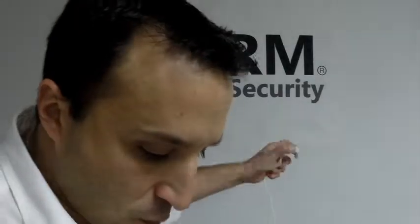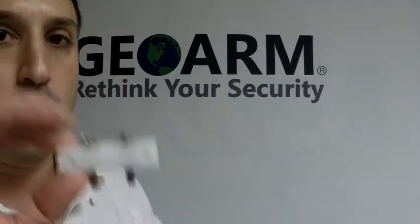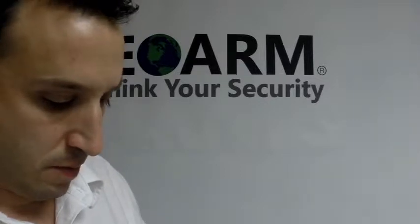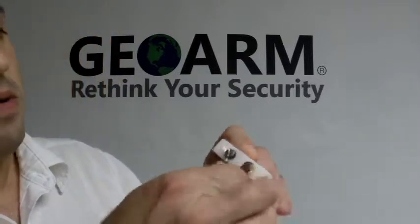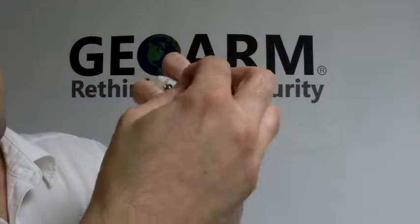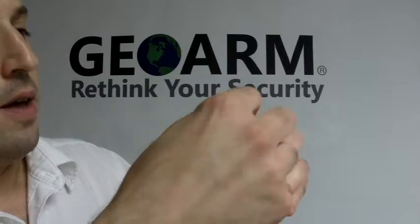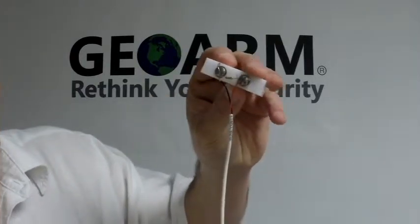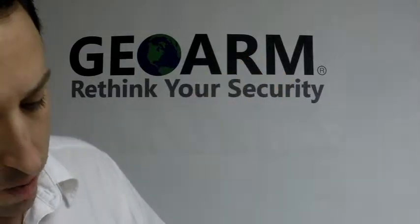When using it for flood detection, you're going to need to put the resistor in parallel with your wiring. So on the two screw terminals on top — one and two — your resistor is going to go in between both. You're just going to wrap that end and wrap that end. Once you have them in place, tighten that down. You don't need to over-tighten it, just snug.